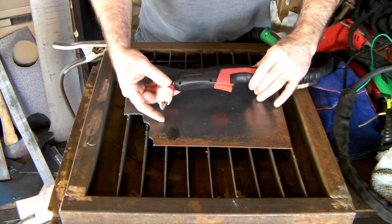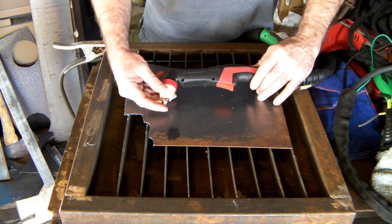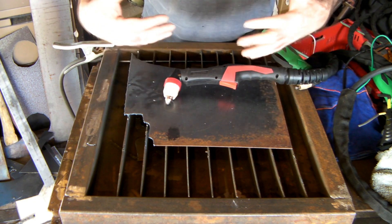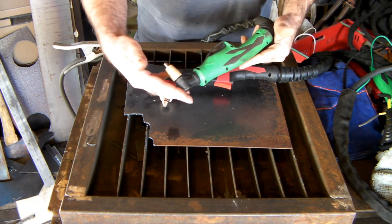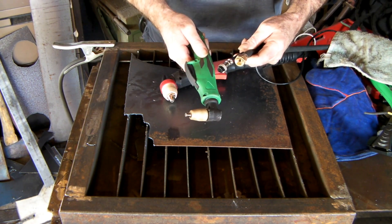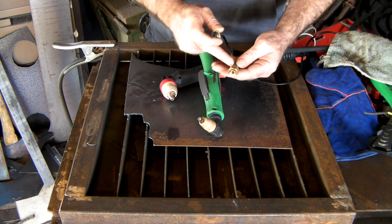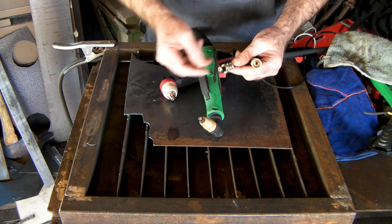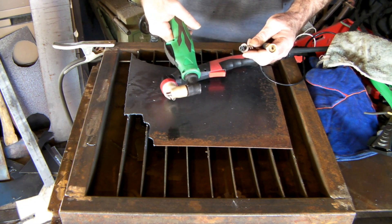Now, say you've already got a pilot arc torch — you've got one from Amazon or from a mate — it's a pilot arc torch. What's the difference? Well, apart from it being pilot arc, there's a difference in the plugs. On the generic Chinese machines — I don't know about branded machines because I use the generic ones — the PT31 torch has a 16mm airline and a heavy power lead running up the inside, plus a little two-prong plug that just operates your on/off switch. That's the basic non-pilot arc torch setup.